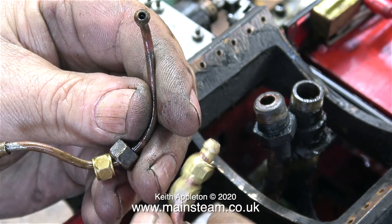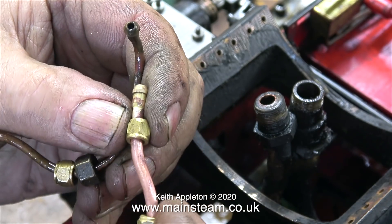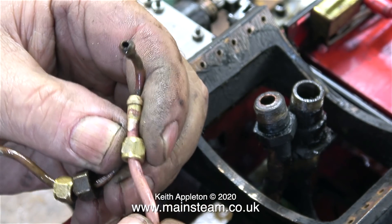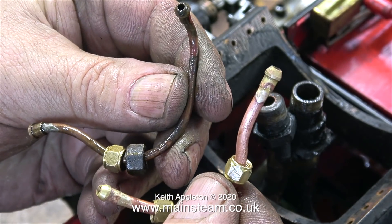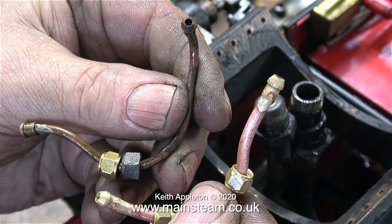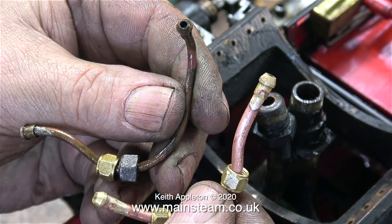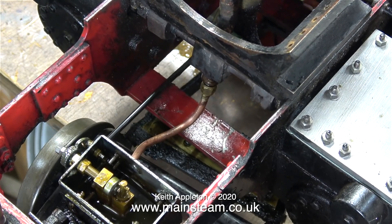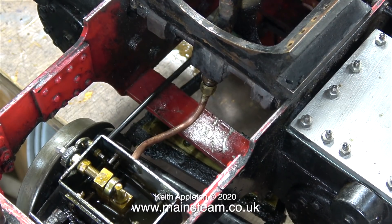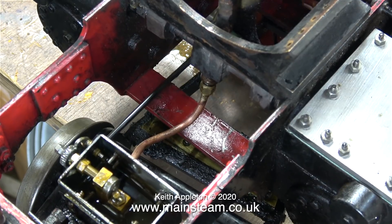It's all very well, but I need the oil pump to do this for me — I can't pump oil into the steam inlet when I'm running the engine. I've made a new pipe and I've made it a lot thicker than the existing one. Instead of using one-eighth pipe, I've used four-millimetre or five-thirty-second pipe. This pipe is a lot stronger and it's less likely to fracture. Also, the oil pump itself is very badly mounted — I'm going to tackle that in the next episode.